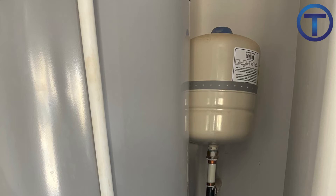Nowadays, we're installing expansion tanks in a lot of settings where there are PEX pipes. PEX is, again, not a strong pipe. So if we're going to do that, it needs to be supported otherwise.